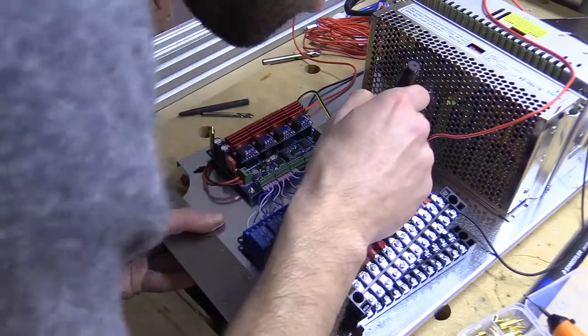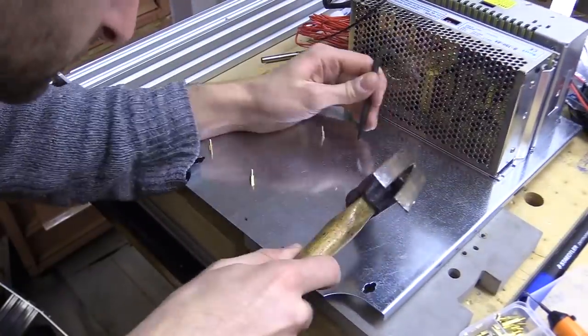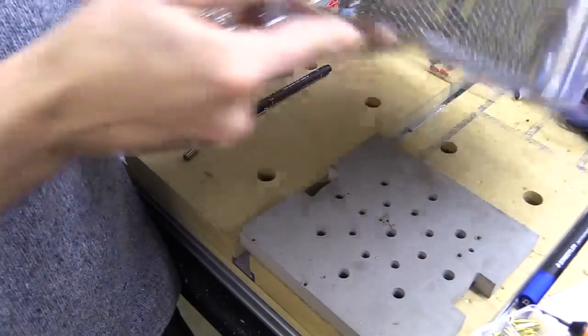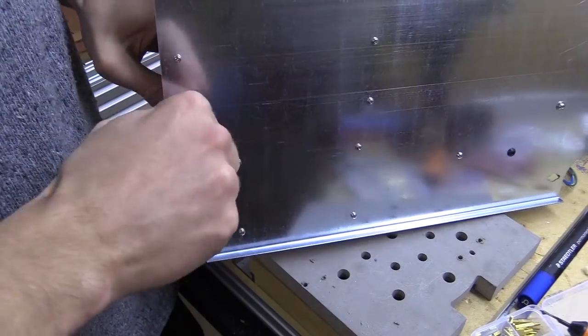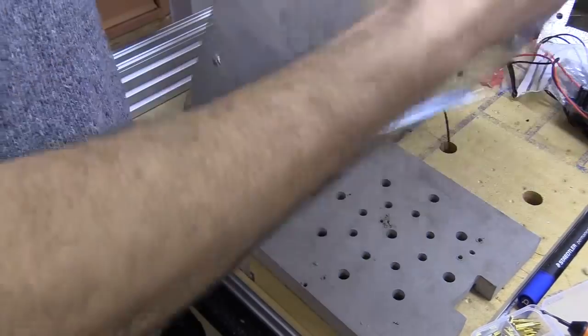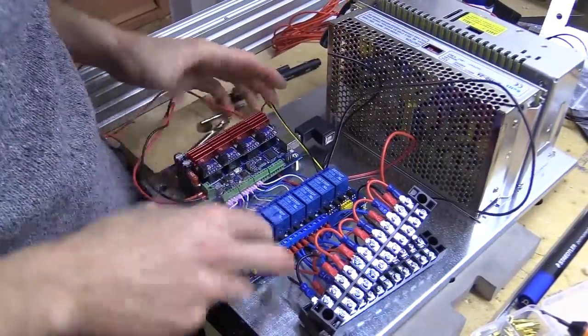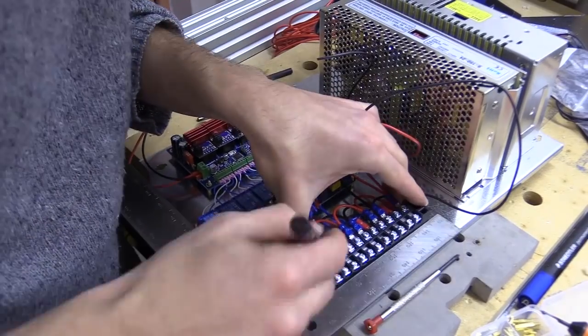This will allow me to control the hand router, turning it on and off with the M3 and M5 commands. I want to have the option to use one in case I decide not to use a dedicated frequency drive and spindle. The other channels could be for the flood and mist enable, or I could connect up some LED lights to illuminate the machine at different states — red while cutting, for example, and white for idle.